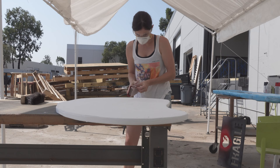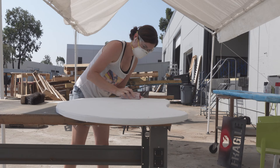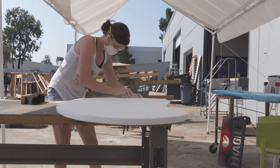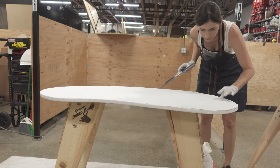My goal was that it would somewhat look like a poured concrete or concrete finish. I did two coats — let one coat dry overnight, then did a second coat. I sanded in between coats just to get some of the ridges out from where I'd used the putty knife. I also had this magic trowel on hand from doing drywall. I'd skim coated walls in our home, so I had experience with that technique. I used the magic trowel for the final coat of concrete and thought it worked out pretty well.